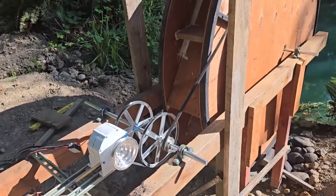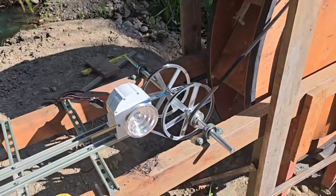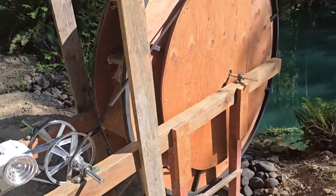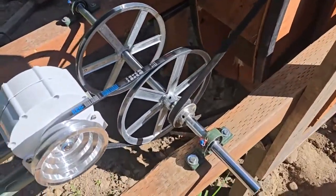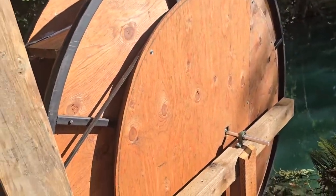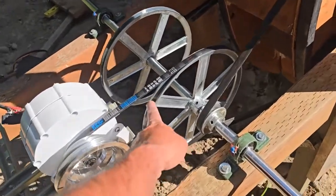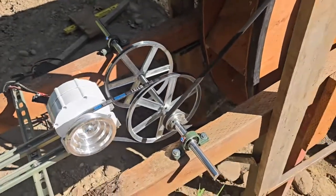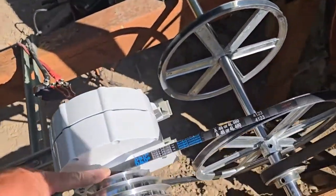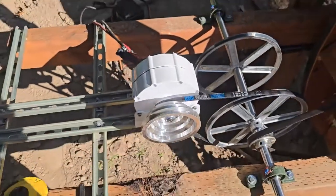We've got one of our drive systems all built on the PMG here. On the big reel there's a five-and-a-half-foot pulley on the seven-and-a-half-foot waterwheel, which goes down to a smaller pulley — I believe a 40 millimeter — giving me a 23-to-1 ratio. So every one rotation of the wheel, that smaller pulley rotates 23 times. Then every one rotation of that, this rotates four times, giving a 96-to-1 on this lower piece — I think about a 50 millimeter.